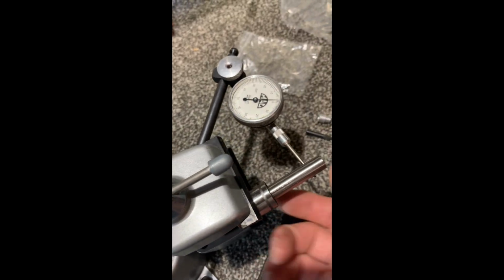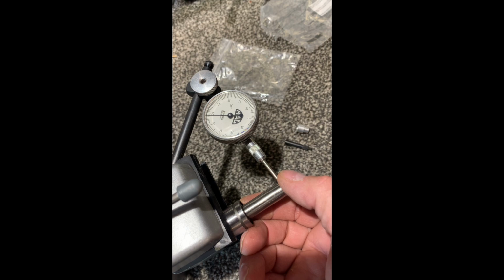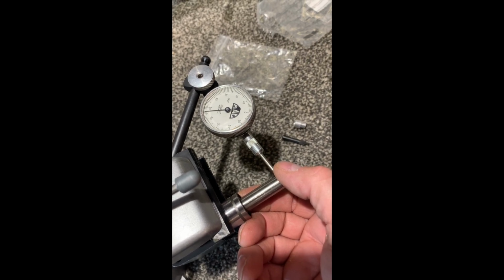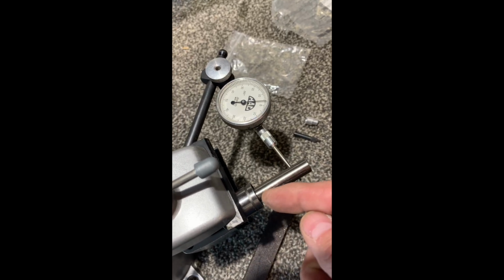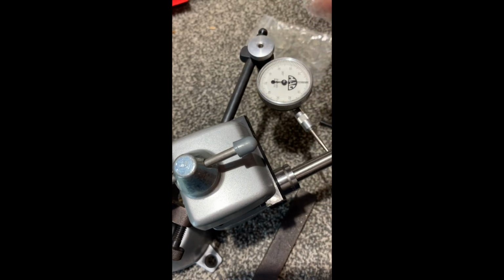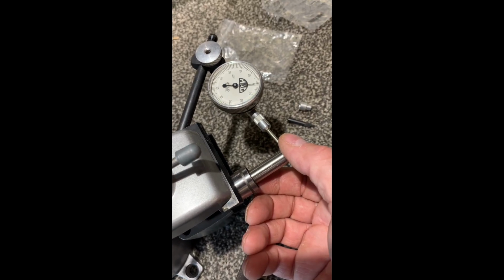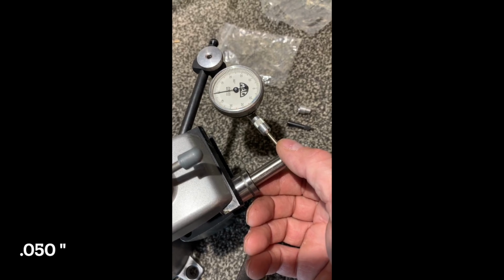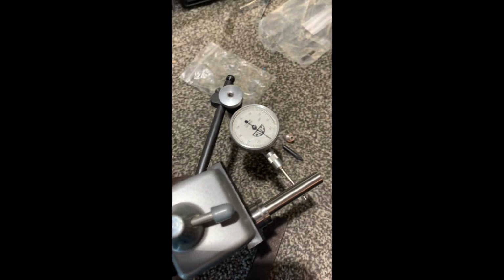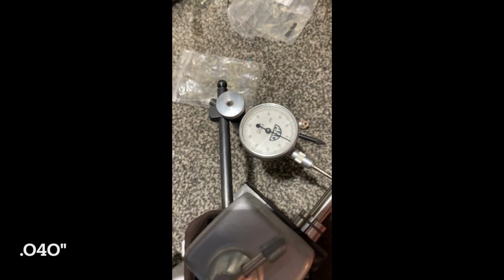All right, this is the old bearing with the bearings on the sides and the tops exactly. Just about 45, 50 thousandths slop. And I'm going to turn this orientation again 45 degrees and see if that makes a difference. Yeah, my gauge setup isn't perfect here, but it's close enough. See, there's 50 thousandths. 50 thousandths slop as opposed to 12. Okay, we'll try this again. Now they're oriented, instead of straight up and down, 45 degrees off. 40 thousandths slop.